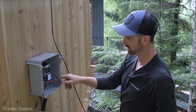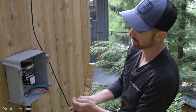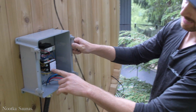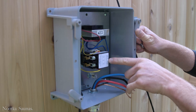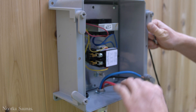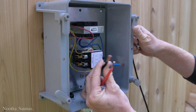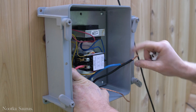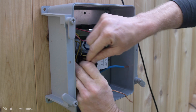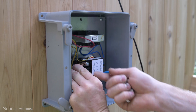Once you run that wire, you're going to connect your tech cable into this panel. You can see that it's labeled 'line out to sauna heater' and 'line in from the breaker panel.' The red and the black wires — that's going to be your power. One of them is going to go into there, the other one into there, and then you're going to tighten the screws down once they're in.